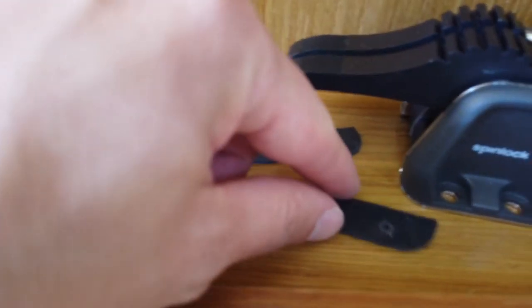Circumstances took me to Essex today and I ended up at a place called Dauntless Yacht Services in Benfleet. They have everything — really great at social distancing, making you wear gloves, keeping you away from other customers. They had all the bolts, so now I have many choices. Today's job is to put the bolts in with some sealant. There's no core there, it's only fiberglass and gel coat, so I'm using sealant and doing them finger-tight, letting the sealant dry to create a nice gasket, then tightening them up properly tomorrow.